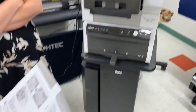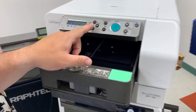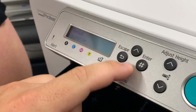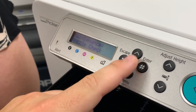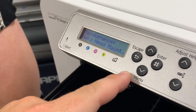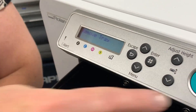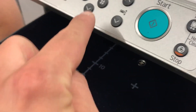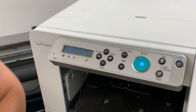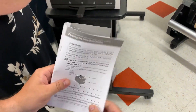Now we're cleaning the print head nozzles. Press the menu key again, go down to maintenance, and select auto head maintenance. Press start — or pound, which is acting as enter here. It will say to remove the tray, so we need to set up the maintenance unit.